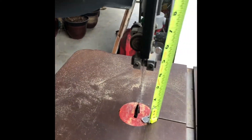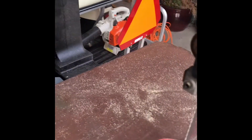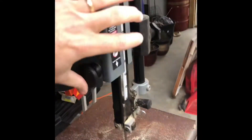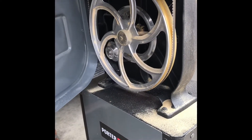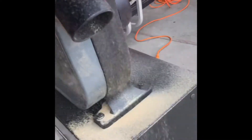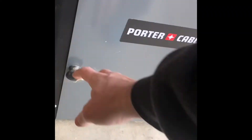The depth of material you can cut is about six inches. It's set at about four right now, but you can adjust it up to cut material about six inches thick. The upper cabinet lets you see the top pulley, the lower cabinet shows the bottom pulley so you can check blade tracking. It's belt-driven inside — motor to a sheave on the back of the big pulley. It also has a shop vac attachment and a cabinet on the underside used as storage, with the manual in there.